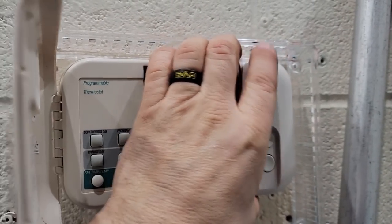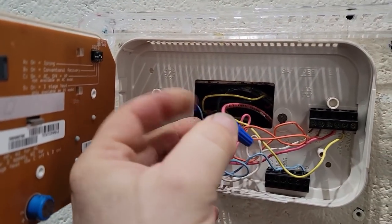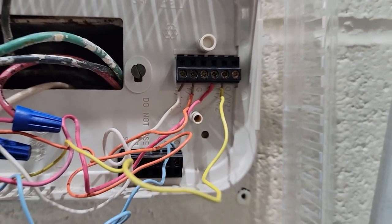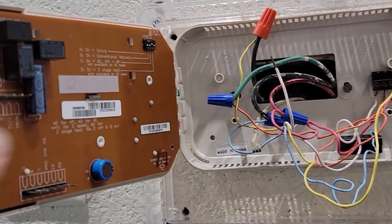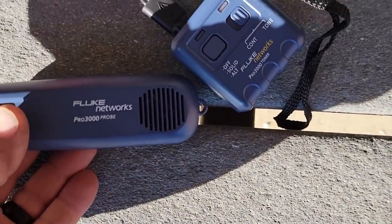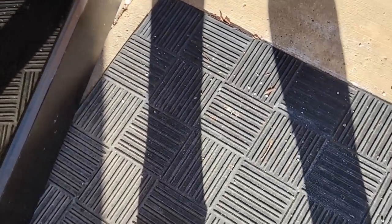It looks like it's dead. I'm going to see if we can pull those back out and put the toner on there. They went from what looks like 12 gauge to thermostat wire — that's not uncommon. I think it's controlling the exhaust fans — what I think it goes to is the little sensor here. You can tell it was in pretty bad shape thanks to the pool. They're going to need a new thermostat; non-programmable is probably the best way to go for the pool area. Let's go get the tracers — it's just a toner, the kind telephone and network guys use.